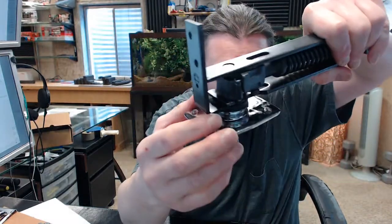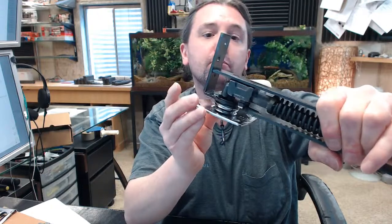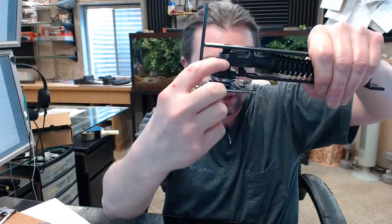This portion here features, because this is a hold open model, a bird's mouth, and this hub here will knock into the bird's mouth, allowing it to hold open at approximately 85 degrees, which is part of it being a 7802. The duty rating, the hold open at 85 degrees, and the non-adjustable spring tension are added to the fact that this 7802 is a model that features a jam bracket. So all of that conspires to mean 7802.